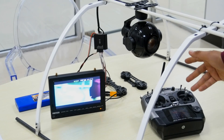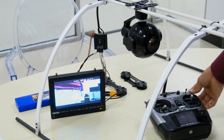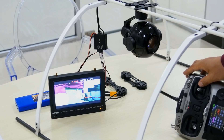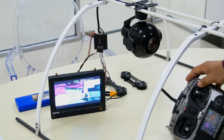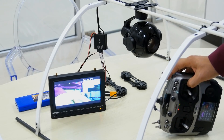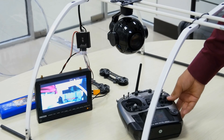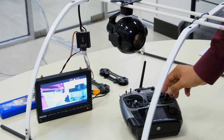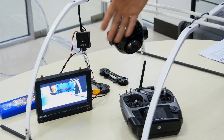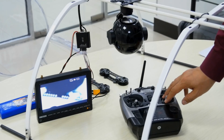Put it back to normal — the gimbal returns to the zero position. If you want to record a video, we assign a three-stage switch: put the switch upward and video recording starts; put it back to the middle to pause. Put it upward again and the camera goes to standby. To take a snapshot, push the switch backward. Push it backward again to take another snapshot. This is how you control the Seeker 30 with the RadioLink H9 radio — pan control, tilt, with 150 degrees to each side and 90 degrees upward and downward on the pitch axis.